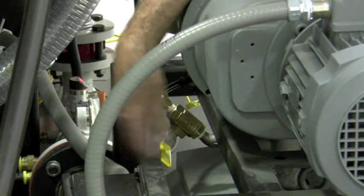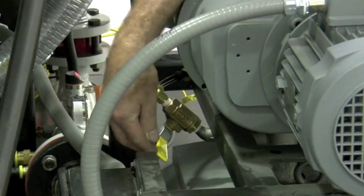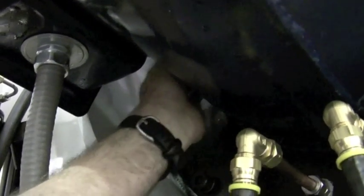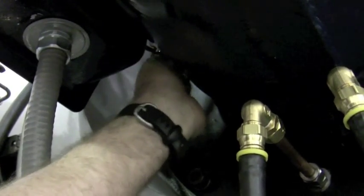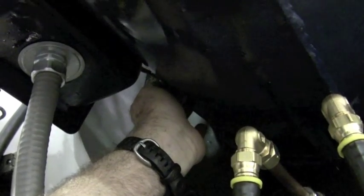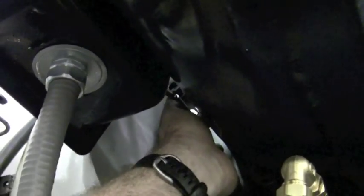Always remember: before you change your cycle or go out of cycle, you want to shut the valve back down. I'm showing you where to check your seal for your gas fan cool shaft. There is a vent on the side of this motor. If you spray your helium in here, it will be on the atmosphere side of the seal. If you get a leak after spraying the helium here, then you've got a bad seal on your gas fan cool shaft.